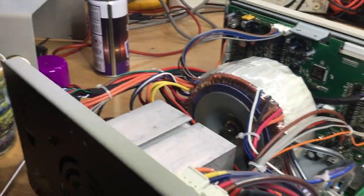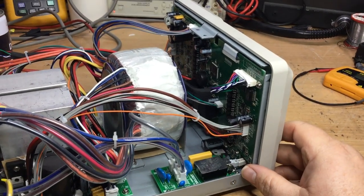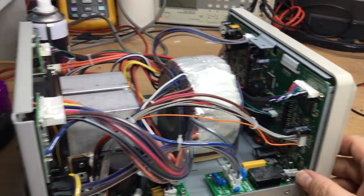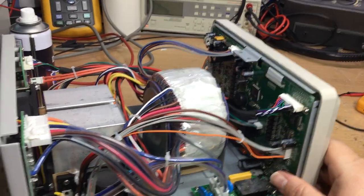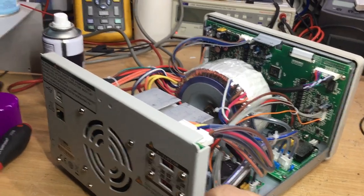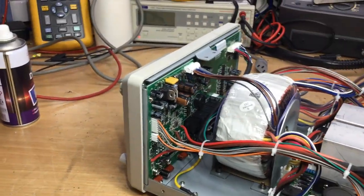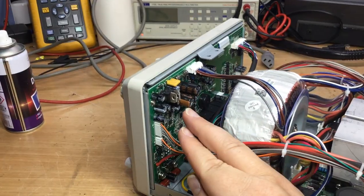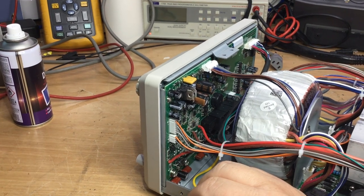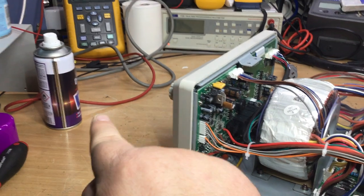But I think it's probably the capacitors on the board. It may be that they all need testing, desoldering and testing with the ESR meter, just to make sure that there's nothing there. Now, I did off camera read the input voltages to the voltage regulators on the Fluke meter, and we had a 1.3 volts AC waveform. It was like a sawtooth wave.